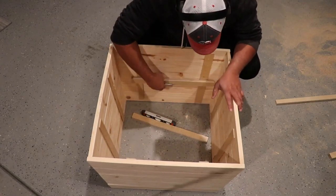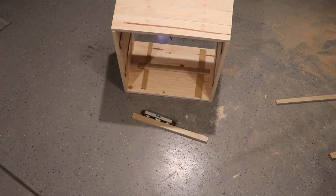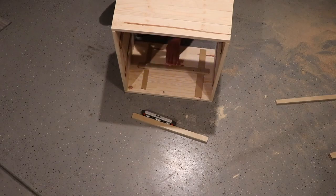I just used two of the blocks, put them together where I found my line at the top of the box — that's going to be the 10-inch mark. I removed the top spacer and drew another line on the bottom ones. I wasn't going to measure it out because three-quarter-inch plywood is not three-quarter-inch plywood and I just wanted a good line. My screws go through that quarter-inch strip and into the panel of wood itself, biting really well. I tried to break these off at one point and they were solid — pre-drilled, put them in there, no glue, perfectly fine.